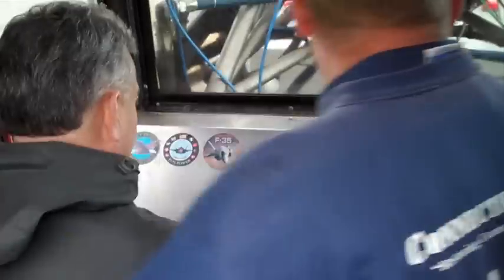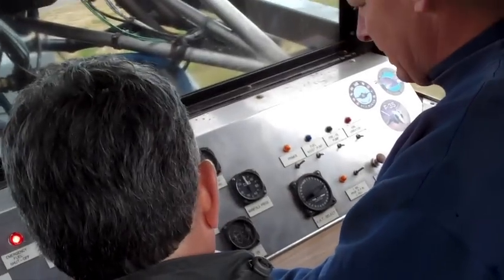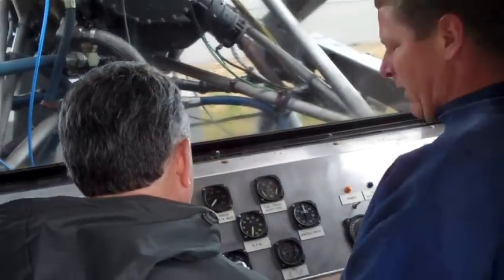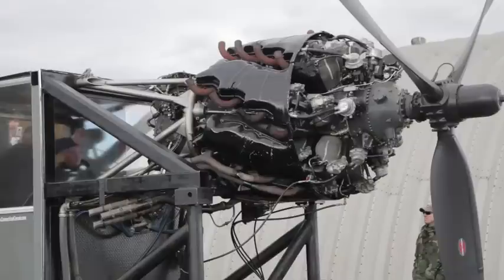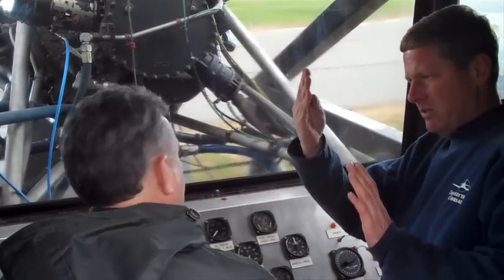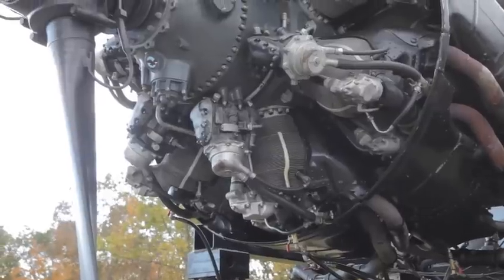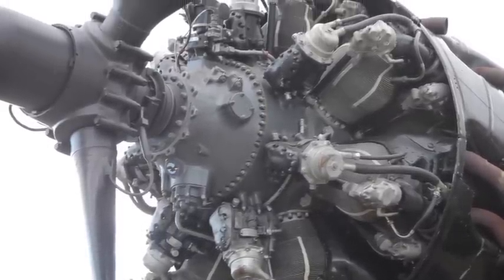Michael, come over here on the left side. This is our battery system — this brings the battery on. We're going to have the fuel off right now because we're not trying to start it. This right here is a live starter — if you hit that, the starter is going to start turning the engine. I'm going to leave the throttle wide open, fuel off. I'll put the pre-oil pump on so we get oil going through the engine, and after about five or ten seconds, I'm going to ask you to engage the starter. When the blade comes by, count it out loud — we want to make sure they're going nice and smooth. If they hesitate, we've got oil in the cylinders. It's got a clutch on the starter, so if there is oil, it'll just stop turning. We've already checked it today, so we should be okay.